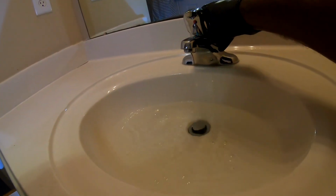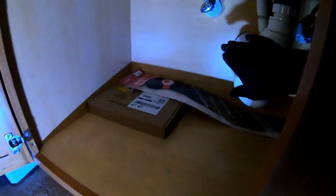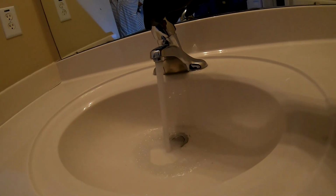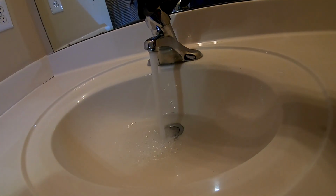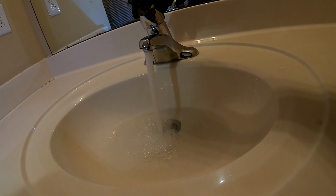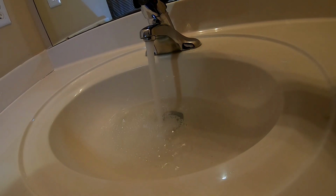It's draining now. When I first did it, this right here was draining out real slow. And when it goes real slow like that, that means it's stopped up probably up in here somewhere. But it's draining pretty good now. So you think we should still put something down in there to drain off? Like just to give it another chance to get on through there? Let's see how it does this time. If it goes fast, I don't think you need it.